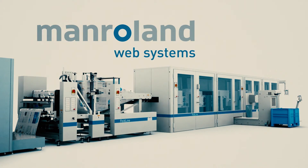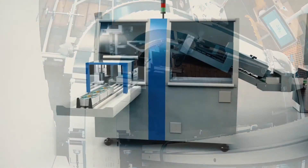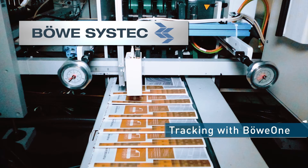The finished product is created with longitudinal gluing along the quarter fold, trimmed within the shingle stream, and stacked at the lift collator to give you an 8-page flyer. In case brochures are missing, feedback for new prints is sent to the superior MIS.